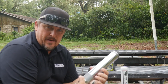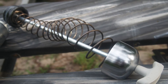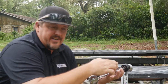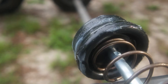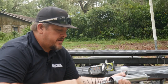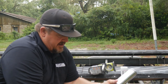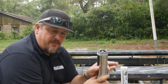Now it's locked all the way back and I can slide this tube all the way into place. Before we get to that, let's look at what's going on in here. If I take this end off — which you should rarely ever have to do — I can pull this out and we see this long spring, which is basically the plunger. There's a little notch in here that actually frees or locks onto that plunger, and that's going to be important in just a moment. So let's put this back in — I want you to understand how this works before you just try to throw something together and make it work.